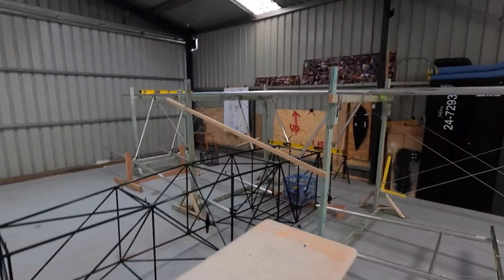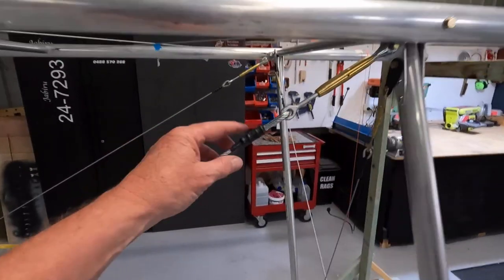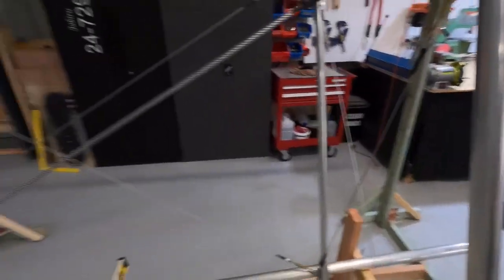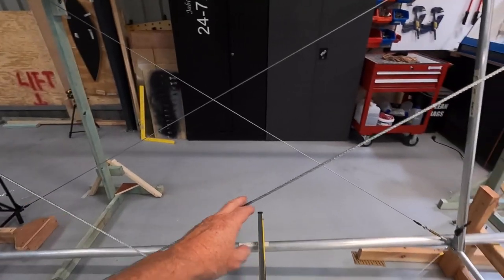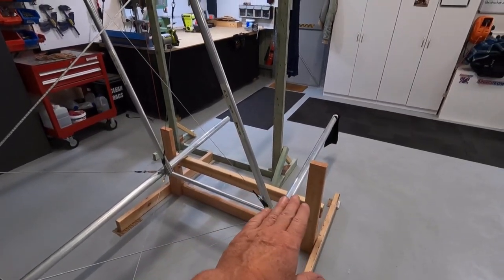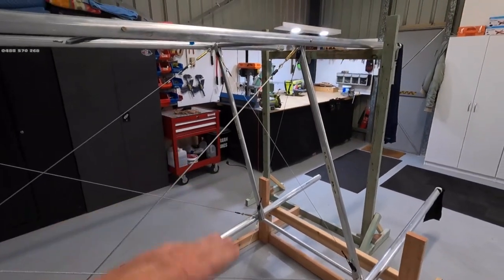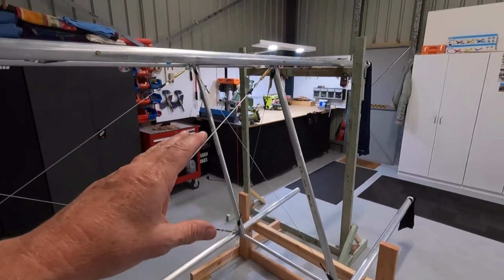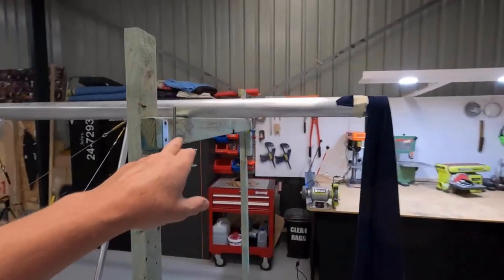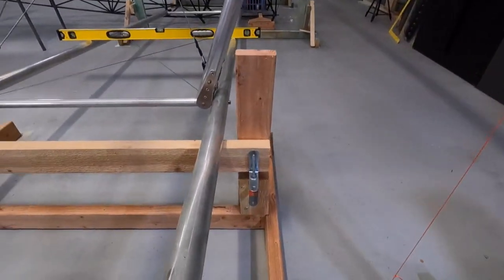Rigged. Got all the flying wires done up. I'll put my bi-seal around these — just needs it up nicely. Everything's nice and tight. I did go looking for cable tensions, but basically what you do is tighten the — lift this — I just lifted it until it just came off the wood, so it's taken the weight, and then tighten this one. They play off each other — the flying wire and the landing wire. Not forgetting you can actually over-tighten these and pull the whole aircraft out of rig. So at the moment it's not actually sitting on the wood anywhere — we are in rig.